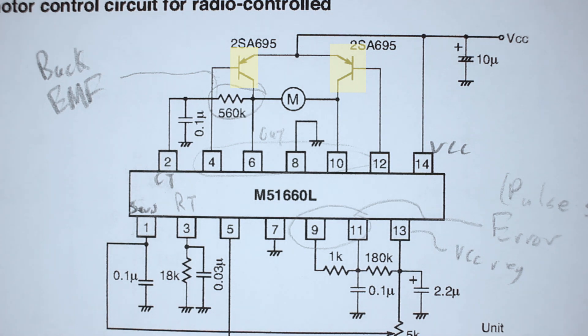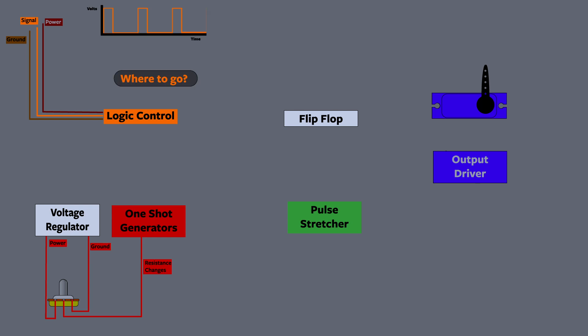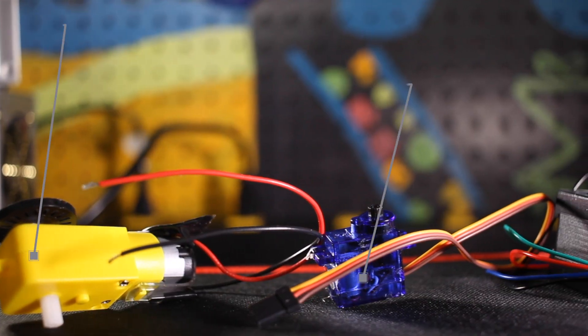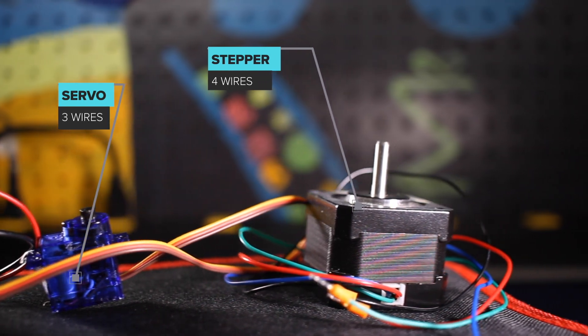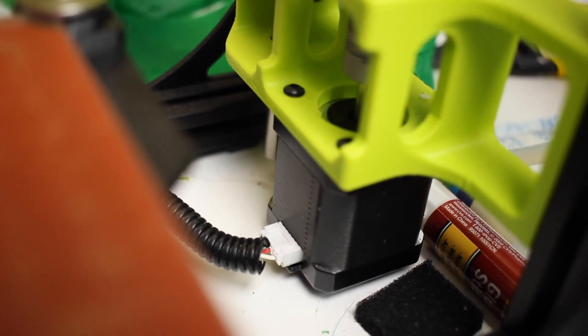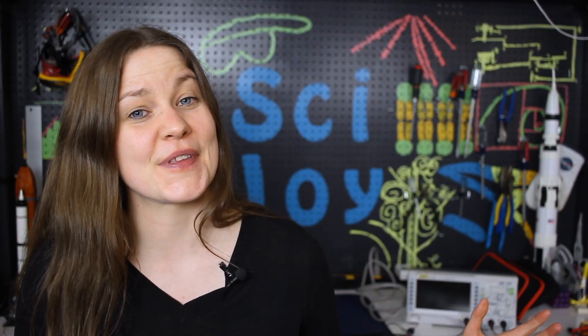So to summarize: where should it go — a PWM pulse from the user. Where am I currently — a PWM pulse from the potentiometer. What direction should I go — the difference between the two pulses sent to a flip-flop. How fast should I go — a PWM pulse from the pulse stretcher through an H-bridge sent to the motor. The whole loop keeps happening until it reaches the right position. Jabril also asked whether there are motors with more than three wires — and there are. They're called stepper motors. The different wires energize and de-energize magnets inside, slowly moving the motor to different positions. This is what we use in 3D printers and CNC mills. Thanks for learning with us and we'll see you next time.